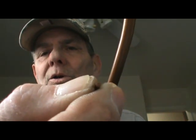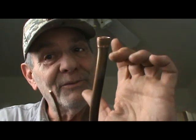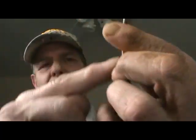And it's designed that this is 5/16 and this is a tiny little hole. The difference between those that drops that pressure to that certain point is calculated to drop it to 0 degrees. Okay? That's the metering system. It's engineered that way. That tube is that size for a reason. It's that tiny for that reason. It has to go to this bigger one, this certain size, to get to 0 degrees, because it drops in pressure and then drops equally in temperature. So it gets to 0 degrees, and that's why it starts to frost the evaporator. Okay? That's how it works.